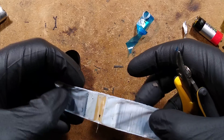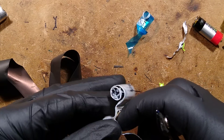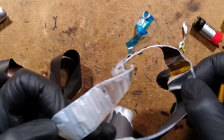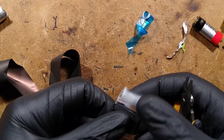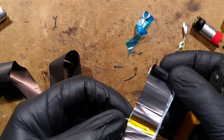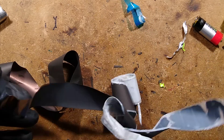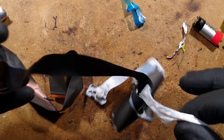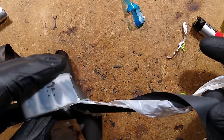It seems to have more layers. Let me pull the separator out. So they've bonded it — not halfway along, but near one end of the roll, the actual electrode. There's a separator, and here is the other electrode. It's just a well-rolled-up piece of foil. Do they have two separate ones? No, this is just the separator with some of the coating on it — either graphite or the lithium cobalt oxide.